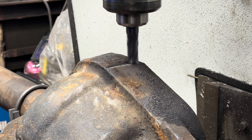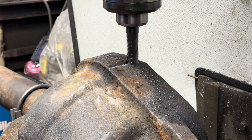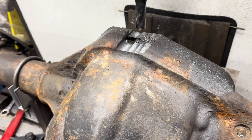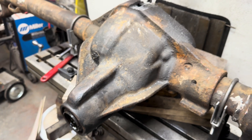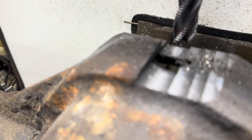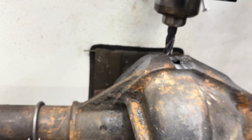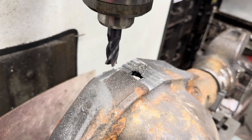As you're about to see, the initial setup of our jig left something to be desired. Our fixturing — since the way we have it clamped — it's starting to pull it in and rock it this way. We started cutting deeper and deeper, which isn't an issue, but something we have to pay attention to for when we get closer to our final cut. So we're going to readjust, have a beer, and keep going.